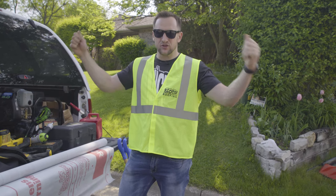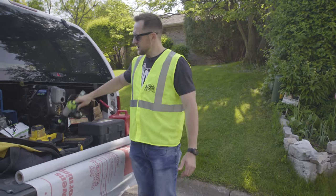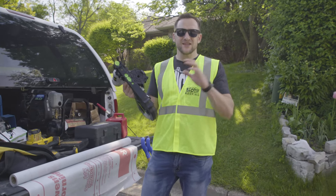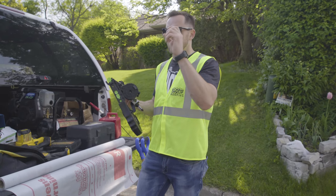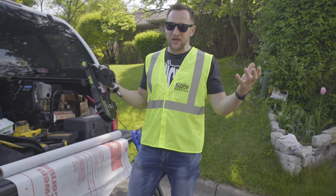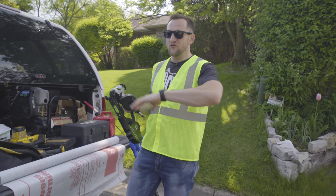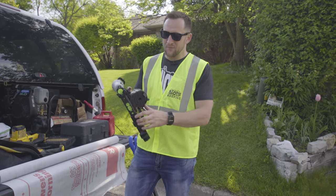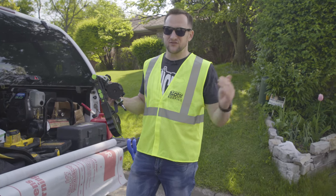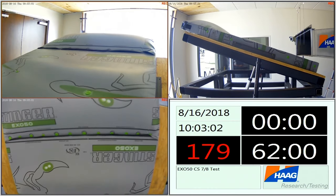You would not want to staple your tarp — don't staple synthetic felt paper. This is the right way to do it. If you go with staples and not cap nails, you're not going to fail inspection and people are not going to see it. Obviously the roof will look good, but you're just risking it. Strong winds, 50 miles per hour plus — if your shingles start blowing away, you want to make sure the roof is not going to leak.